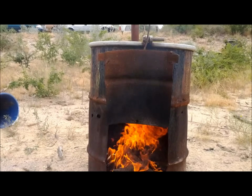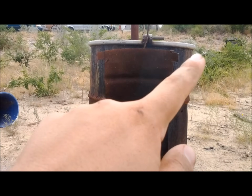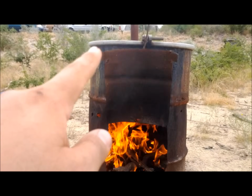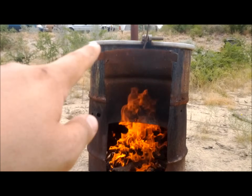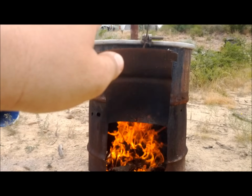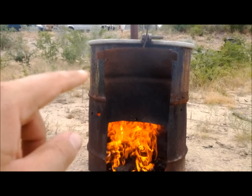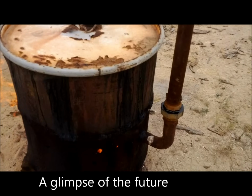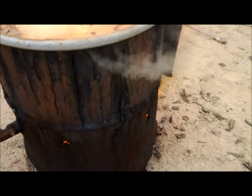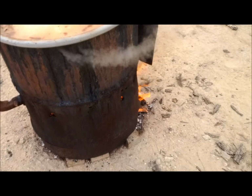These tendrils of smoke that you might be able to see coming from right there. There's other little kernels of smoke that come out under that ring. That is the beginning of the wood inside the barrel beginning to char. Resin will stream down the sides, and when the smoke and the resin stop, I know that the char inside is done. Now you should be able to see the rivulets of moisture and resin that are pouring down around the edge of the retort.